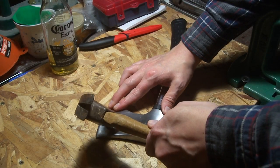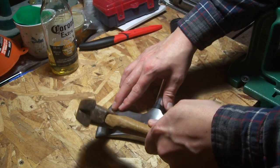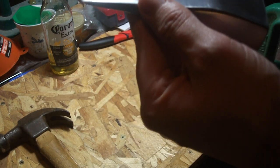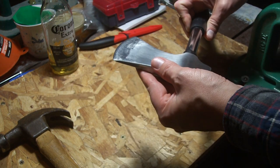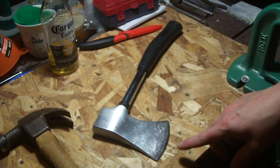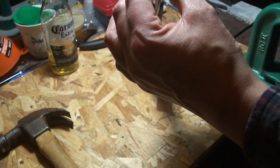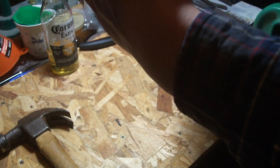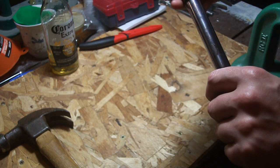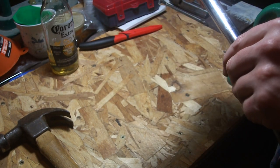You can hit above that line and there's a bunch of dents. When you cross that line, it stops. So it's not super hard steel — it files fairly easily — but it doesn't roll when you chop hardwood. It's sort of when you get a really thin edge on it and you're chopping hardwood, the edge doesn't roll over, but it kind of compacts or gets crushed in. You feel kind of a burr, but it's like the edge got crushed.